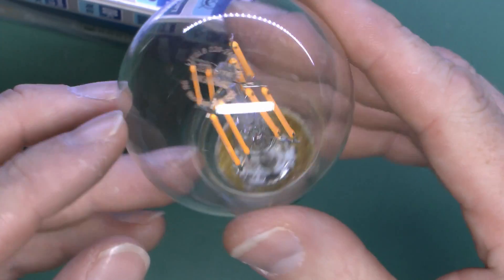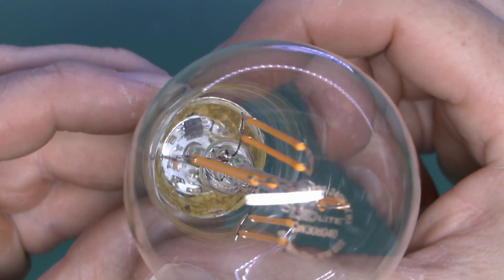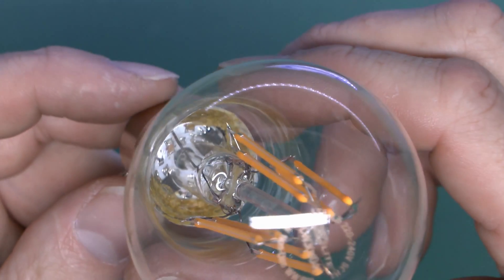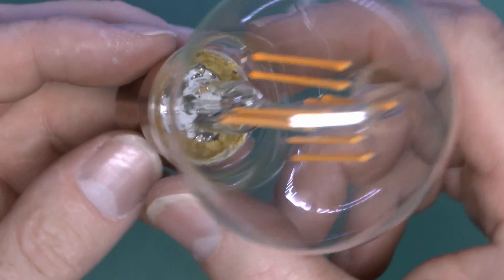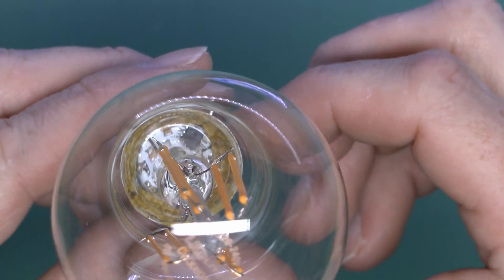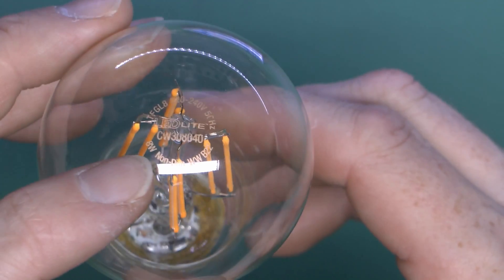On the top there it's just got the stamp with the brand name, voltage, and rating. These are stated as non-dimmable, and the reason for this is — looking in the bottom — you can see there's actually a six-pin chip on that side, so it's obviously not just a capacitive dropper; there's actually a chip in there to control the current. There are a few other components on the surface, probably a couple of resistors. On the other side there's a four-pin chip, which is presumably a bridge rectifier, so there may be a capacitor in the base somewhere. It's definitely not just a capacitive dropper and rectifier — there is at least some kind of control going on, hence it's only marked for a specific voltage: 220 to 240 volts, 50 hertz. It says non-dim on the top as well — warm white, 8 watts, B22.